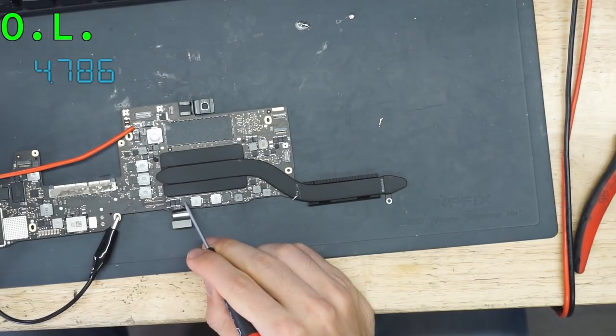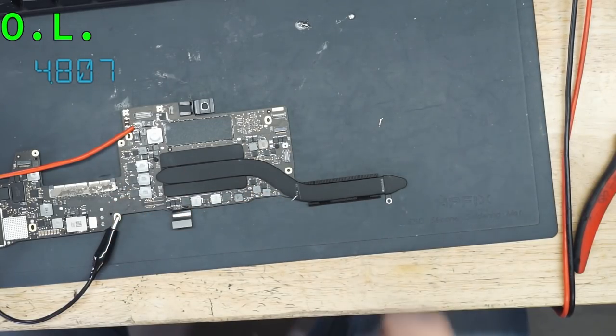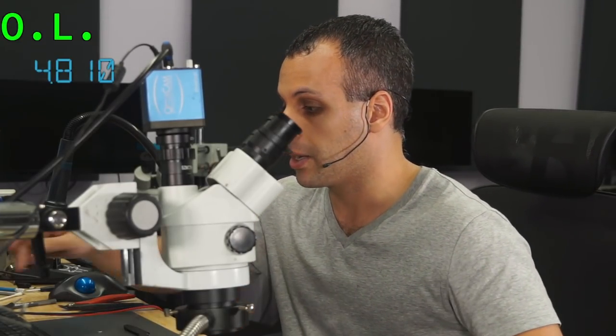And although your board may have started with just one transistor failure, once you do a short test with a high voltage, now you've caused a CPU failure, and now you have a system that's not economically viable to repair. So when doing a check for a short, using the lowest voltage of any rail in the system is a safe way to go about it. If the lowest voltage that anything in the system uses is 0.65 volts or 1 volt, start at 1 volt. This way, you don't have to worry about screwing anything up downstream.